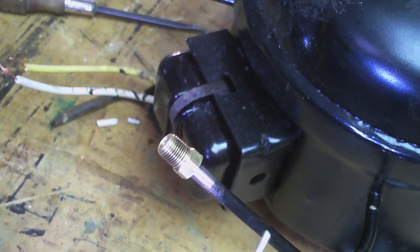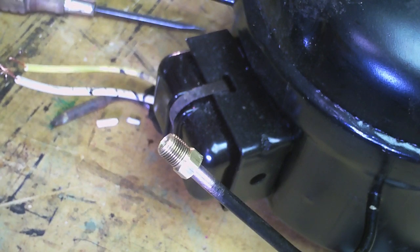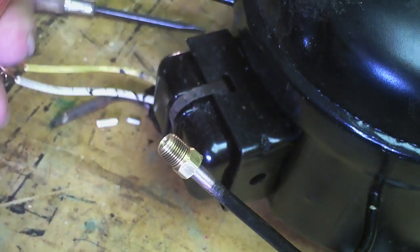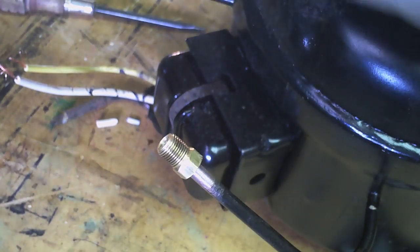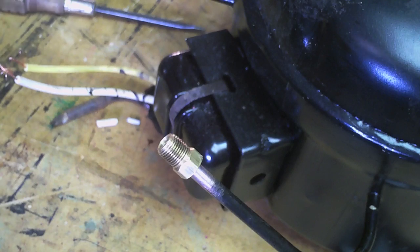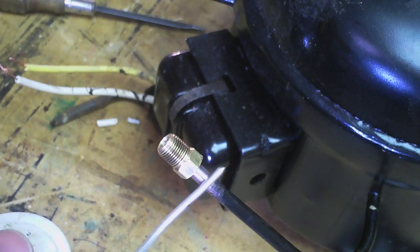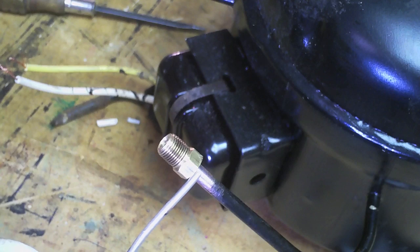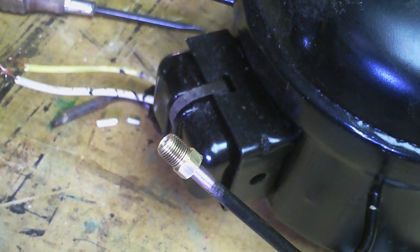We're ready to put it together. I polished up my metal line, and I have used some very ugly stuff. It's called tinner's fluid. It's, for the most part, hydrochloric acid in a squeezy bottle. I got a little bit on my hands — I can tell because it's burning. I'm going to have to go take care of that. I would expect you would use regular plumbing flux, but it's not rated for these pressures. Come on, guys — it's a tiny, tiny, tiny line. So if it blows off, you're going to hear a hiss, but you're not going to have a rip-roaring, building-killing explosion. That said, if you have a rip-roaring, building-killing explosion, this video is for entertainment purposes and is not to be repeated in any way. I think it'll be fine. I'm going to heat it up and see if we can get it to stick.